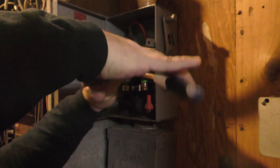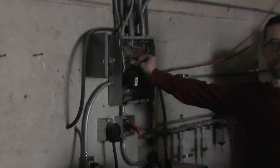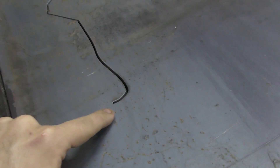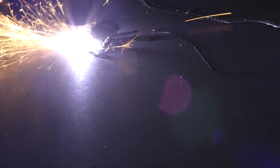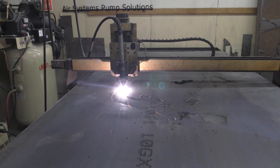All the way down there is the room with the fuse panel that runs this sub panel right here. We didn't have to do anything in here — it was all down there. We fixed that, everything's working again. But here's what we were in the middle of: we had a cut that started right here and had run all the way over to here when the machine cut off. So what we're going to do is load up the exact same file, except in my G-code generator I'm going to tell it to start here again — that's its default start — and then we're just going to run the cut backwards, go this way, meet back up here, and then manually kill the torch. That will deal with the mistake, and then we'll go back and finish out the rest of the sheet the way we should have in the first place.